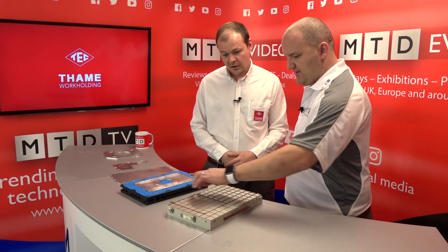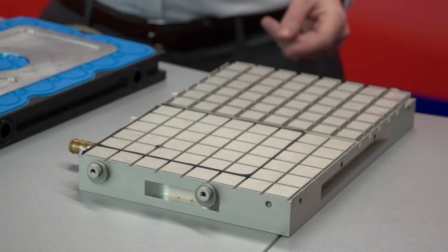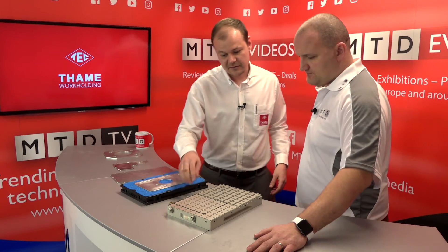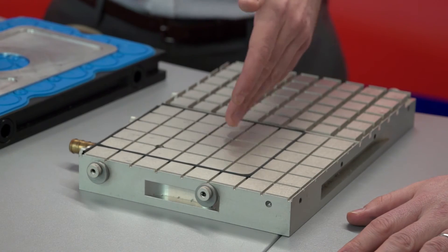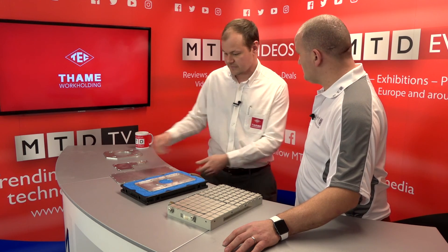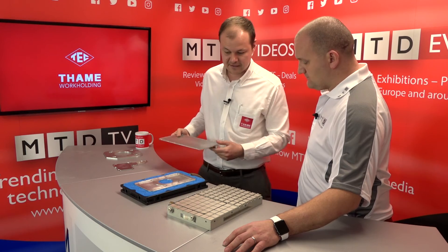How does this one work — the one where you have to put the seal in? This is a slightly more common type of fixture, and we do these in various different sizes. You put the seal into the various channels to blank off the area of the fixture where you want to generate the vacuum. You can do smaller parts on these, but you can't go through — if you're machining through, you're going into this fixture and you don't want to do that. Is this an inferior or cheaper product? It very much depends on the application. You get slightly better flatness tolerances on the grid fixture, but most components have through holes or you want to go all the way around the outside — and the only way you can really do that is with the vac mat.